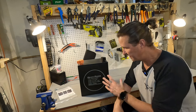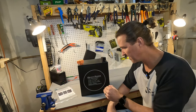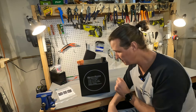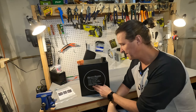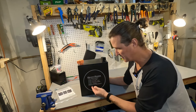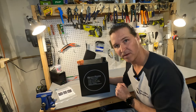And there it is. It's from Orient Power — it is a LiFePO4 battery, which is lithium iron phosphate. The model is OP12V230. Its rated voltage is 12.8 volts nominal. Its rated capacity is 230 amp hours, which means the energy is 2,944 watt hours. It also shows the website as opsolarbattery.com and info@opsolarbattery.com as an email address.